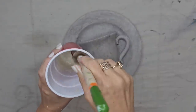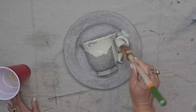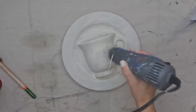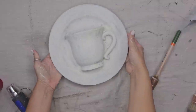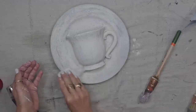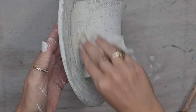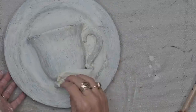Now I want to add another layer. I mix up some milk paint in the color London Fog and I'm just going to put one coat on here. Ideally you would let your wax dry, but I don't have time for that in this video, so I'm just going to layer it on. Now I'm going to take a heat gun and dry this milk paint really quick. Now we have even more texture with that milk paint. I'm going to take a baby wipe and just lightly go over the entire piece to bring back those two shades of gray — the Fusion Cobblestone and the Dixie Belle Grey Grunge — adding lots of dimension.